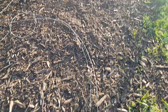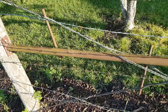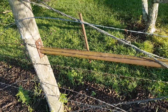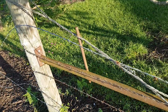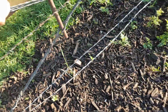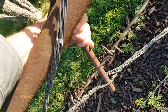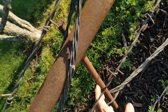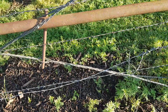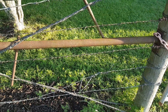Let me take you over here to what I'm talking about. This is all the wire — I didn't want all that tension on there. This fence right here has the stays I'm talking about; it's got four stays. For those of you that don't know what a stay is: they're metal bars — you can use metal, you can use rebar, some people use wood. What happens is they're literally just put in here, then they're spun around and it's just under tension. As soon as someone slides that off even a little bit, it falls off and that whole wire loses tension. Design flaw — well, maybe not; people are just working with what they've got.